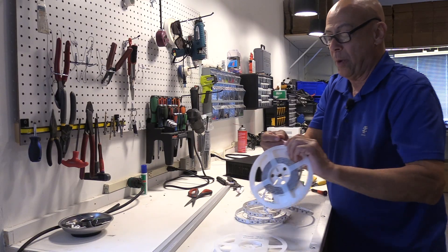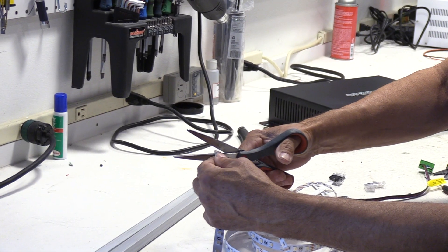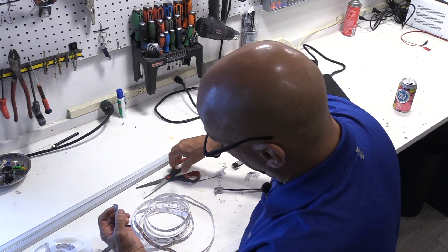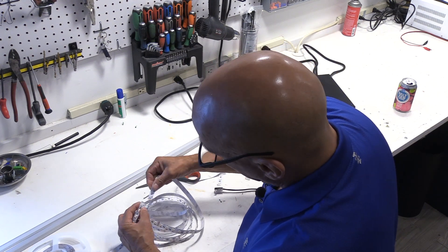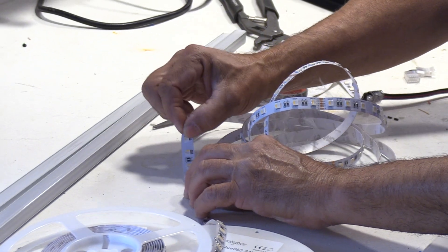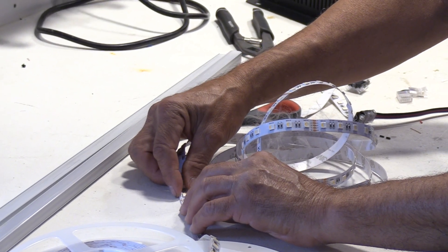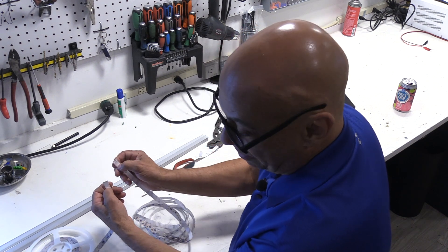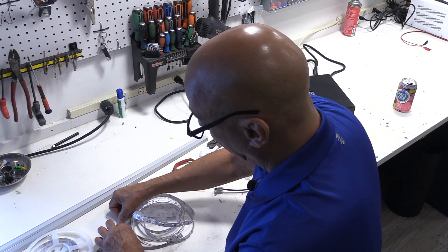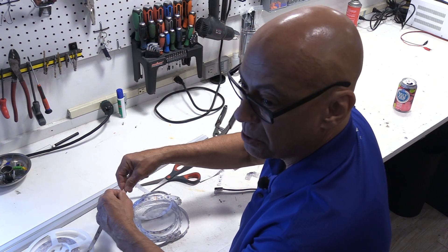If you're really good with this stuff — Chris does this — you cut it right at the edge, not on it, but at the edge of the copper connectors. You lay them down together like this and run a bead of solder very precisely right across it. It also helps to use a 3M adhesive — just get a little piece of plastic or something to stick this to. That becomes part of it; you can cut and trim the sides, giving it some stability and strength to the solder joints.